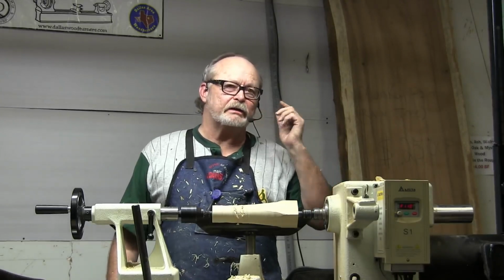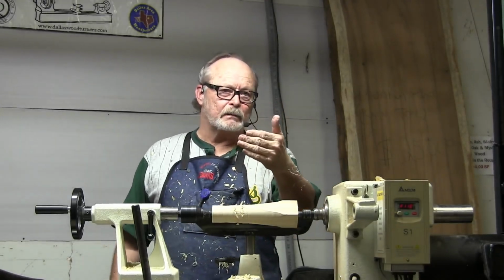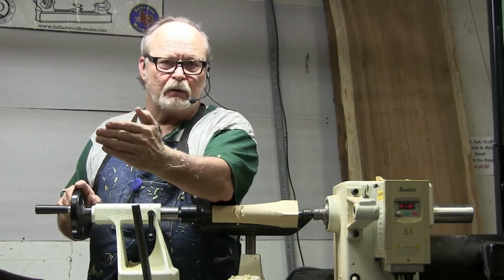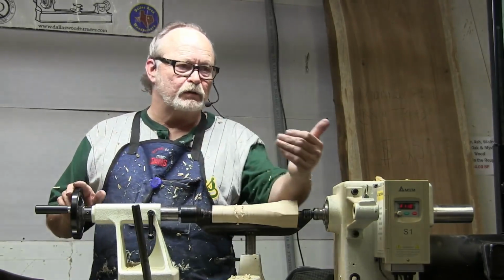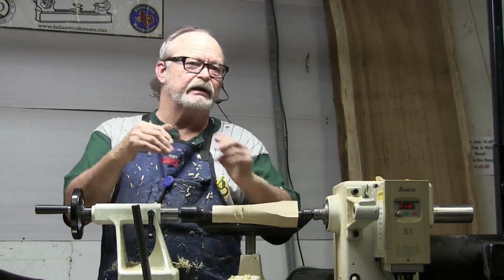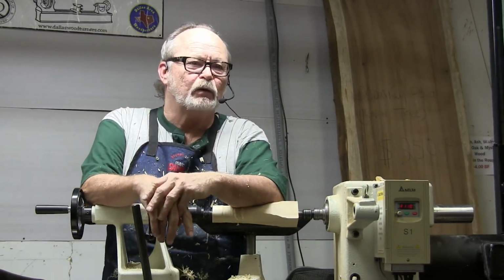And bowl turners get it too when they try to enter a bowl, or down deep inside when you're trying to go through dead man's curve. If you get a run-back there, it throws the tool into the inner wall, the trailing edge hits, and that's a classic dig-in, and that's drama in woodturning.